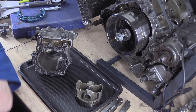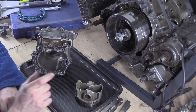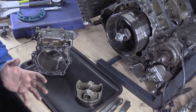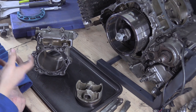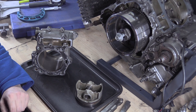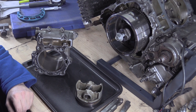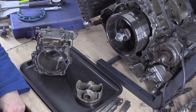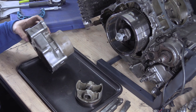Touch this the minimal you can. The cylinder is covered in scratches, as you can see from the pictures. You can see there are honing marks — some scratches will be deeper than others. The shallower scratches will disappear quicker than the deep ones. Don't be alarmed if you see something like this on a bike that's done about 50,000 miles. It's not the end of the world — you can basically see the deepest hone marks that are left in there.